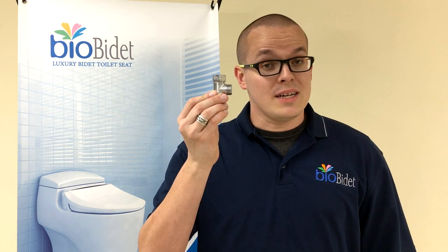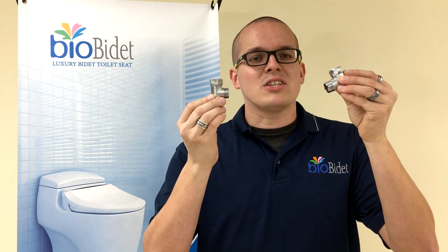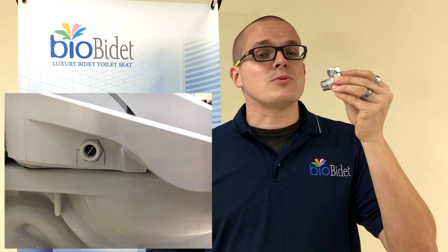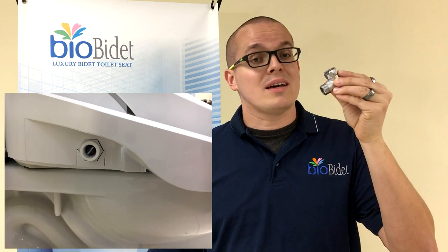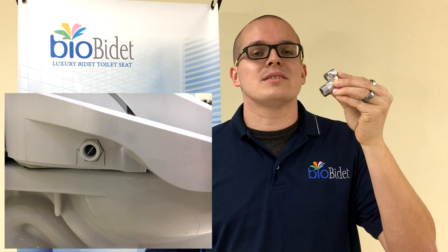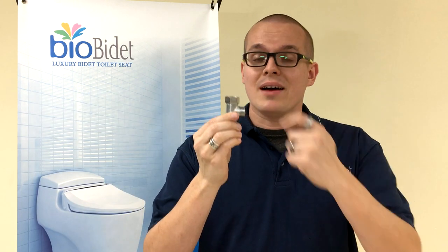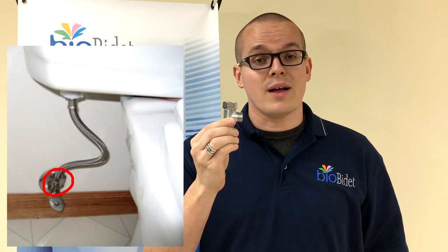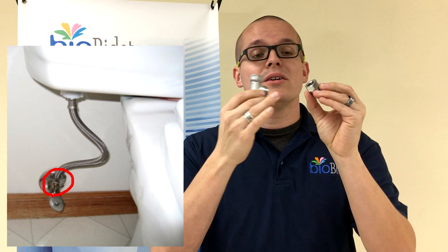The BB600's installation hardware is going to come with some slightly newer pieces. It's going to include not only your T-adapter, but also an L-adapter. This L-adapter is basically just an elbow — it's going to secure directly onto the inlet of the bidet itself to make it so your supply line leading to it is nice and tight to the side of your toilet. The T-adapter is going to have a half-inch pipe thread on the end that secures to your water shutoff valve. It will also come with a 3/8ths conversion nut in order to secure it to a 3/8ths compression thread.